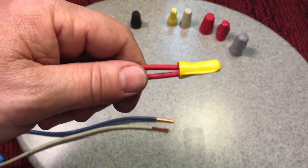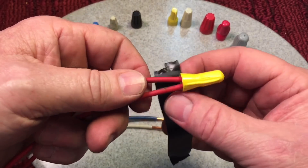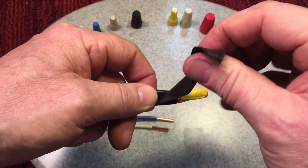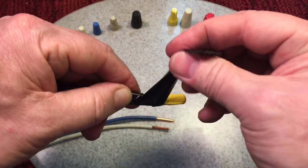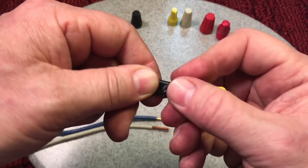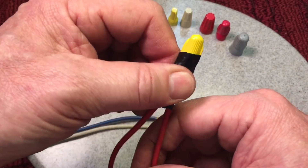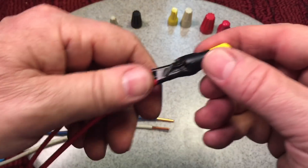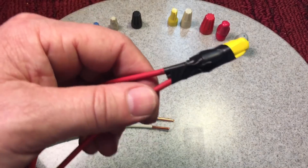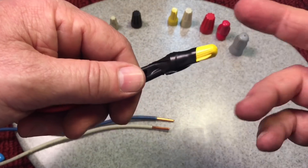Let me tell you the other thing that I do, and I still do today — and the electricians, it's almost embarrassing to show — but then we would take a piece of electrical tape, wrap it around the wires and then wrap it around the wire nut. Does this look familiar to some of you? This is the way a lot of my receptacles, lamps, hallway lights, porch lights were done. If you see tape on there, that was probably Grandpa's doing. Is that redundant? He always did that so this thing couldn't twist off or fall off.